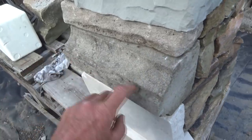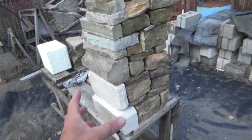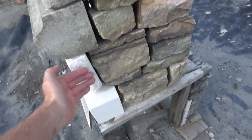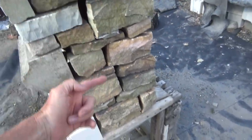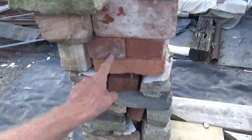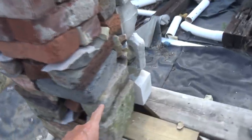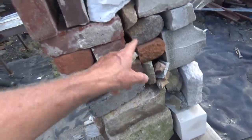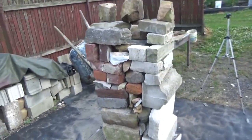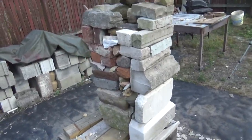Here's a carving I got down at Tomassetti's, and I want to explain to you about restoration. But this is the basics. Usually these old buildings, they would facade it like this. They toothed it in to the side stones, or brick if they're doing that. But when you get around the back where no one's looking, they fill it with junk, different kinds of stones, pieces, blocks. And you're going to see a lot of evidence of this when we go to these castles and the places that I'm talking about. So that's basically how they would build it up and down. We're going to do a good demonstration and show you how to look at this kind of stuff.